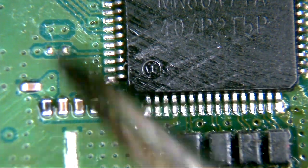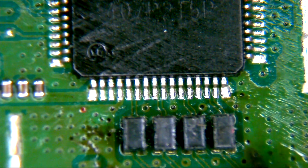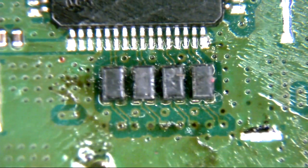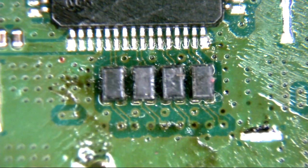This over here is an empty pad anyway on this AB revision board, so don't worry about that. Everything else is fine - we just need to go over here and get rid of this flux residue. We're just going to pop this back together once that's done and we're done. So we've replaced those two coils, the encoder IC, and the HDMI port. We've just touched up those ground pins as well. We ended up re-replacing the port because I don't know where that iffy one came from - bit weird. But anyway, it's all done. We're all good, we're working, and ready to go back.